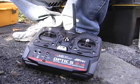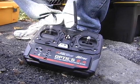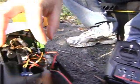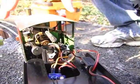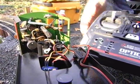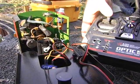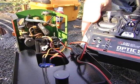Before adding anything to the locomotive, it's a good idea to check the controls. In this case, we have RC or radio control. If you have RC, make sure that you turn on the transmitter first, and then turn on the receiver. Once these are both engaged, you can check the operation of the controls to make sure that they are operating as intended and freely. If you don't have radio controls, you should still check that all the hand controls are operating freely and correctly.